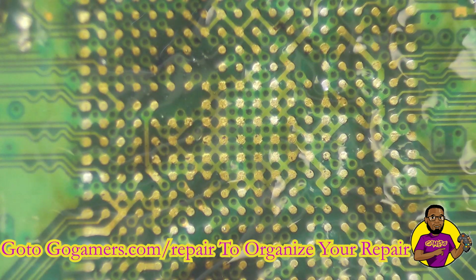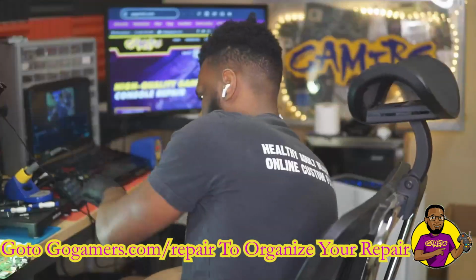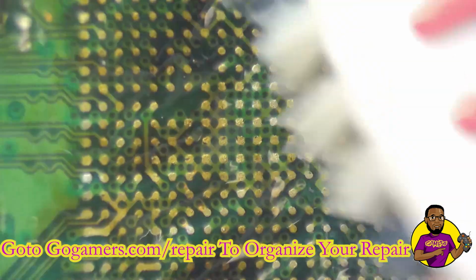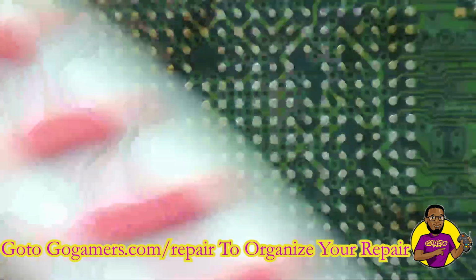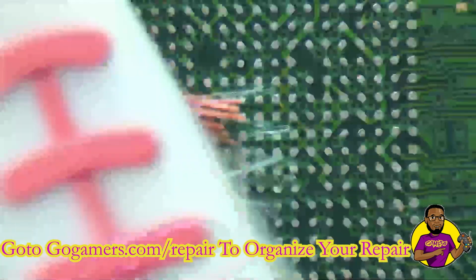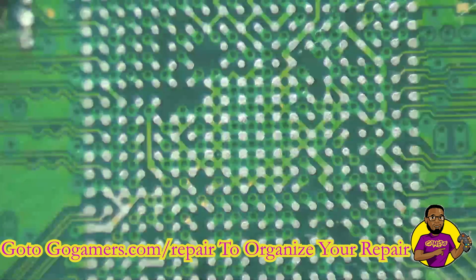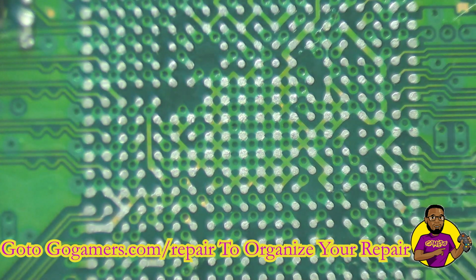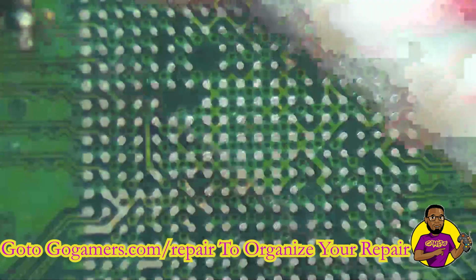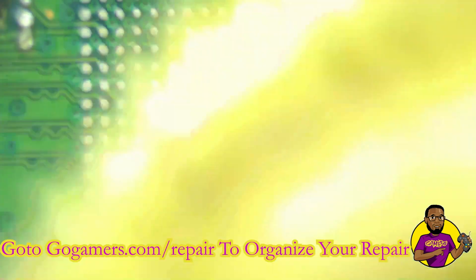All right, so what we're going to go ahead and do is take my toothbrush and this towel. I just dipped it in some 99% IPA. Now we're going to clean off this board, because it looks like we did a fairly decent job with just that one desolder braid, which means we did really well with the initial process of using that low melt solder to quickly get off that solder. And I'll warn you guys, if you do not switch over to the low melt solder, it's not a problem. But a lot of times, if you move the wrong way, you can rip a trace, and trace repair on a chip like this is not fun.